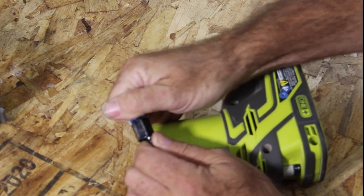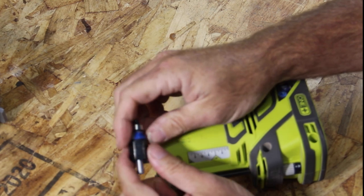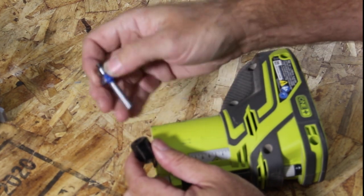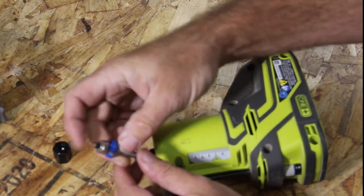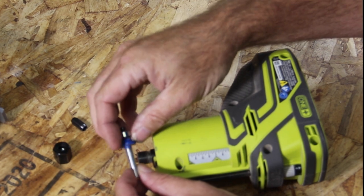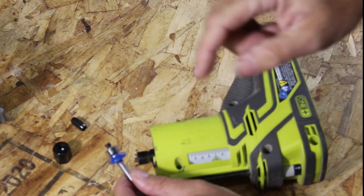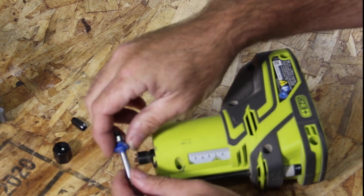And what has happened to me in the past is while I'm routing, and no matter how hard I tighten the collet nut down, this bit starts sliding. And I had a project almost ruined because the bit slid down and gouged into the project. I was actually able to fix that by unfortunately routing deeper into the project. It wasn't ideal for what I needed, but it actually solved the problem. And this is a Ryobi bit, and I will have a link to the bit set and all these tools, as well as some of the other Ryobi tools I use, in the description below.